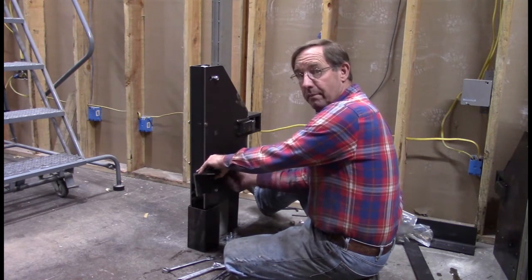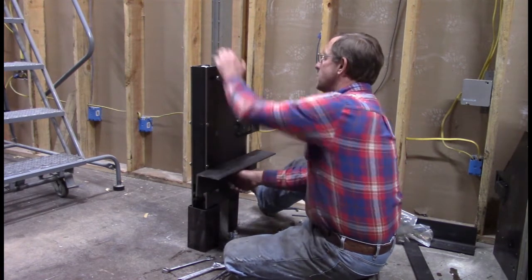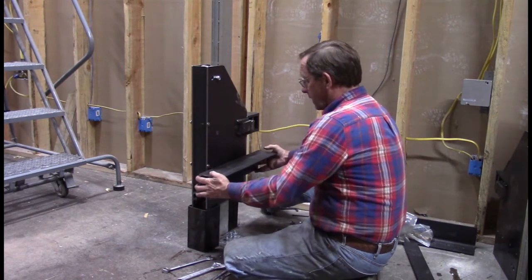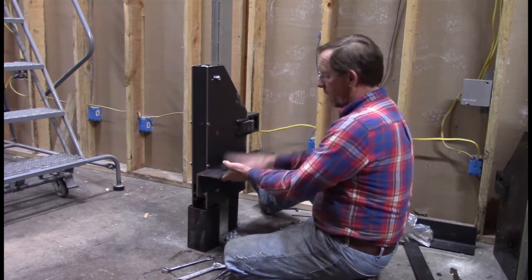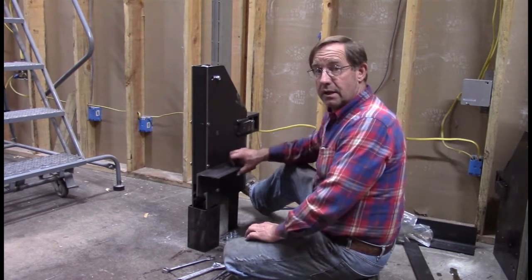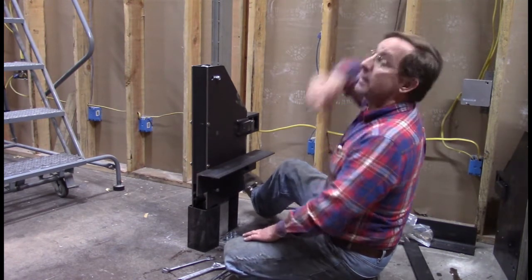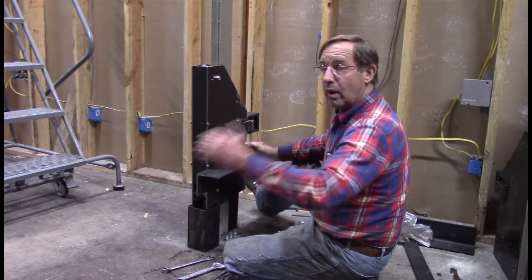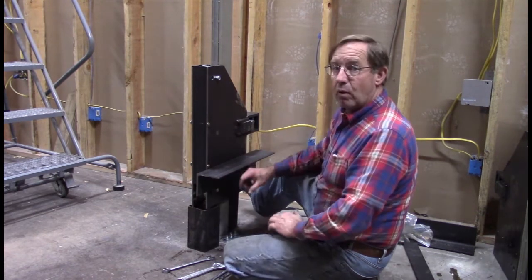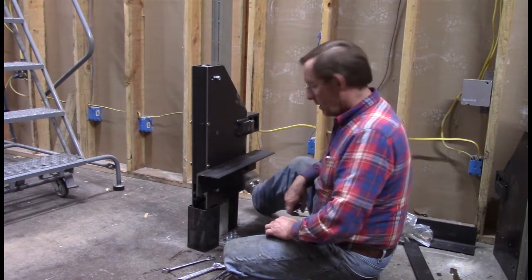Found on the two center ones that I'm not able to put the nuts on those because it ends up hitting the standard, so we can't do that. So basically, like I said, this points back and forth. The carriage will be a solid welded base that'll fit between here and the standard behind me, and then we'll have a top on it. Lifted by the crane here. It'll stick out about 2 feet this way, and it'll stick back nearly to the wall, and this will be the platform that we put our goods on when we want it to go up to our next level.